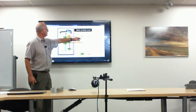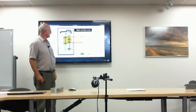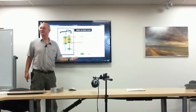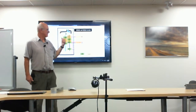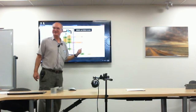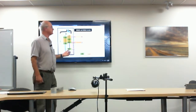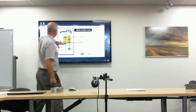Essentially you're dealing with your black, white, and ground wires. If you're going to work on this stuff, turn off the power and use a flashlight. I know it's a pain, but it's an even bigger pain if you don't — you might not have finished the day. So this is the basic layout you're going to encounter in your panel box.